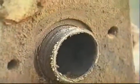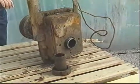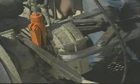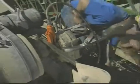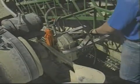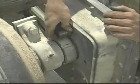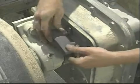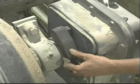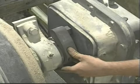Severely corroded or weathered applications like these are the real test of a taper bushing's design. Often the so-called designed-in removal methods offered by many manufacturers simply don't work. In many cases, a puller must be used, or the bushing must be broken in order to remove it. But if a Falk Quadrive should ever become so corroded or fretted to driven equipment that standard removal methods fail, Falk's optional TA removal tool provides a fail-safe removal solution.